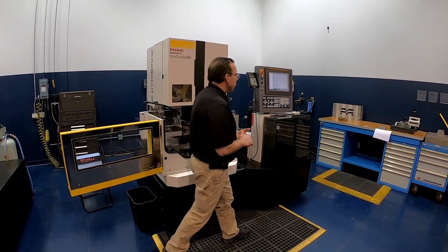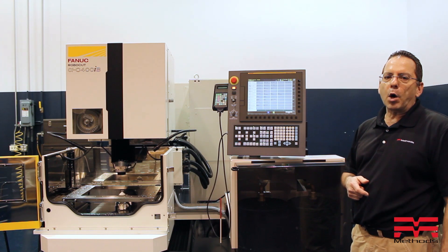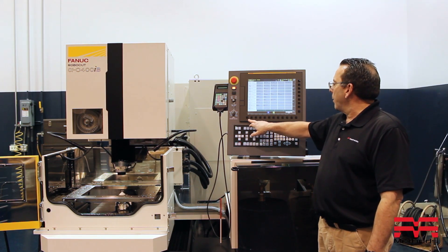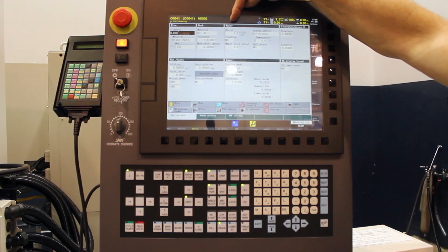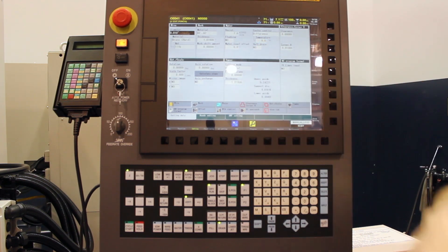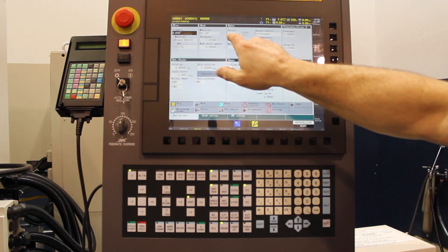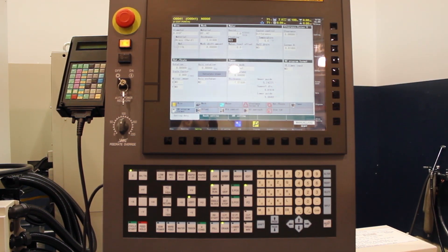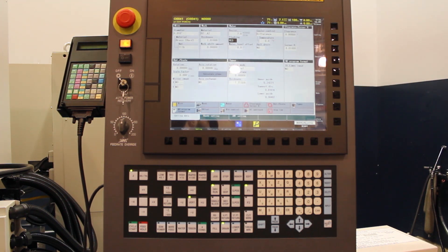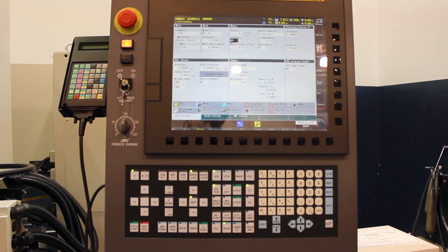The second thing we need to do is come back to our machine tool and tell it that it's in flushing mode. To do that, we come along the bottom here to our settings page and choose this. Right over here we have something that says 'water' and we have the capability right here — it says 'flushing.' Basically, 'no' means the machine tool is going to submerge. All I have to do to run non-submerge is change this to 'yes.' Now the machine tool thinks it's what they call a flushing machine, meaning we're only pushing water from the upper and lower flush cups down into the cutting area. Once we're done, all we need to do is come back here, deactivate this, and change it back to 'no,' and basically it's a submerged model machine again.